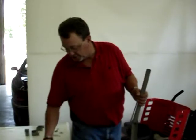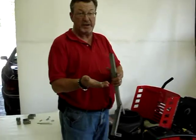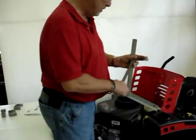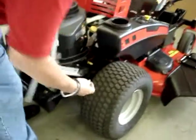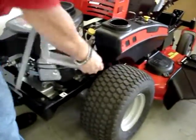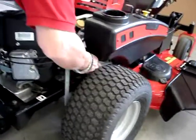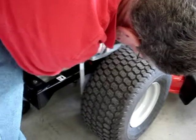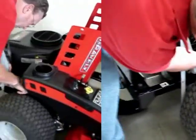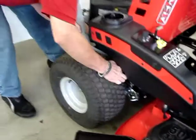Put it on the right-hand receiver. Use a 3/8 by 1 bolt, 3/8 lock nut, and a 3/8 very thick washer. Place it back here. When you first install the bolt, just place it through that hole — through the hole in the unit, the receiver, behind the tire.